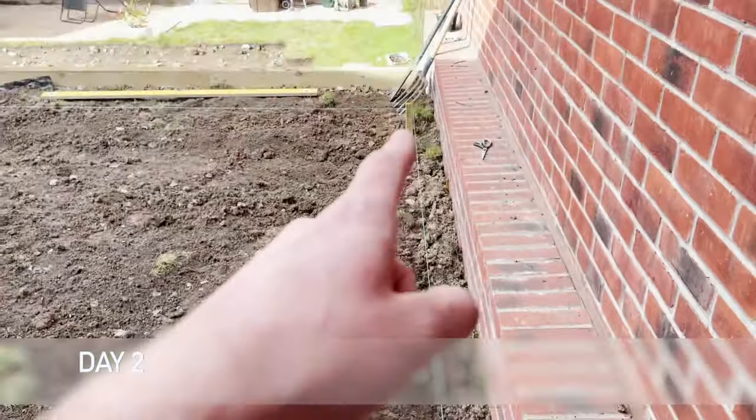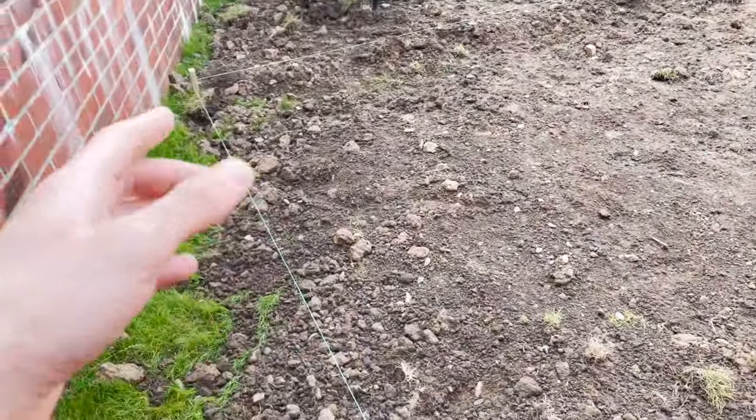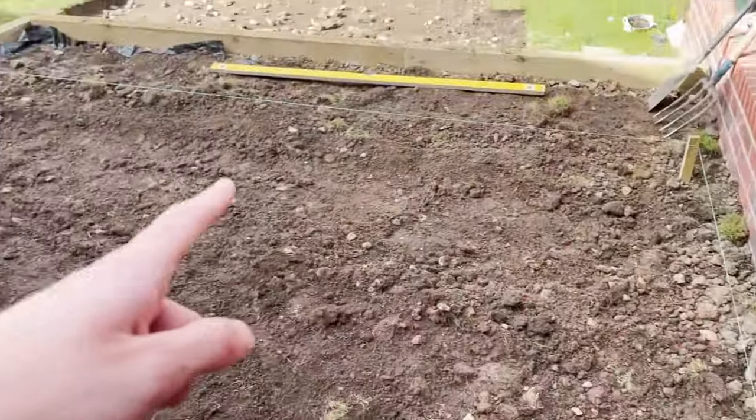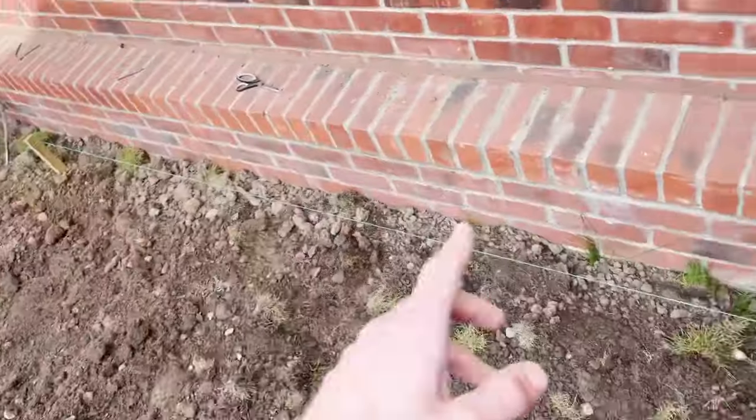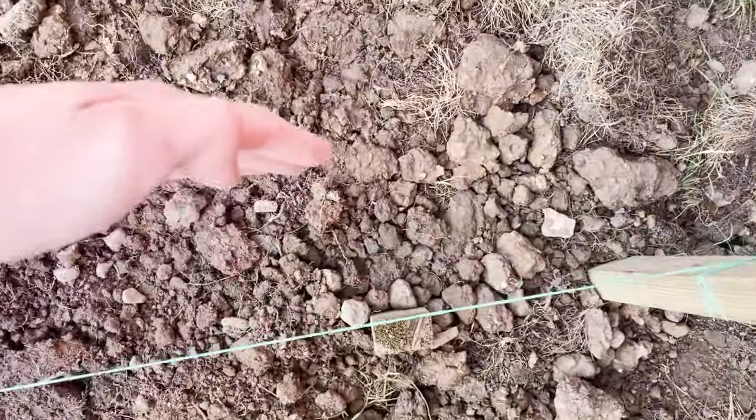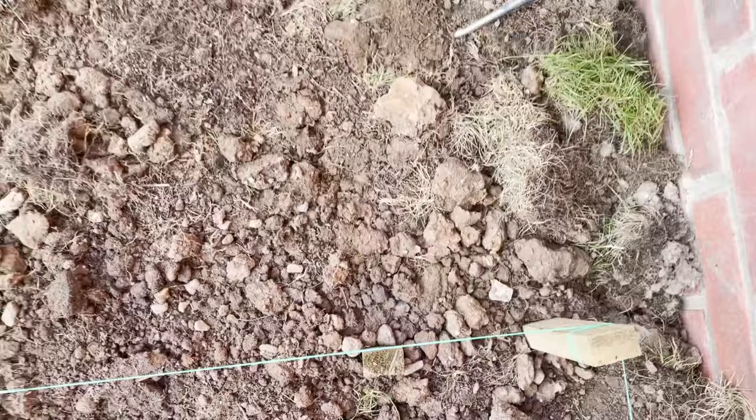So as you can see, I've knocked four posts into place and positioned them where the patio is going to be, with a string line all the way along showing the top level where it needs to go. I've made a bit of a silly mistake — I measured exactly the length that the six patio flags are going to be, but obviously there'll be a space in between them. I've estimated between seven and ten mil for each slab, so we are going to need a little bit of extra space. When it comes to digging out these spaces today, I'm going to dig out just beyond the actual string line itself.